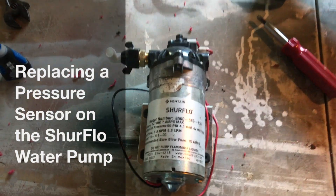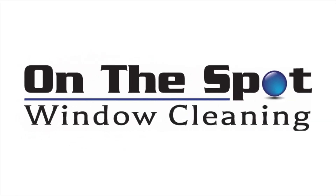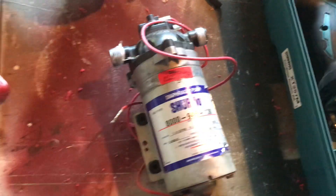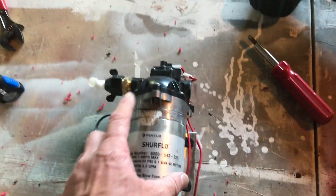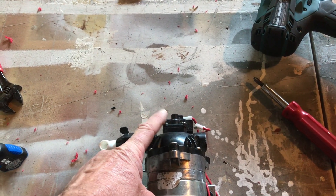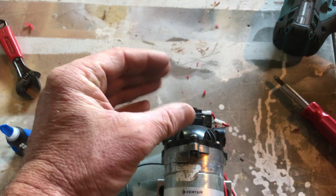Today we are going to try to resurrect a couple of pumps. A very important thing to know when you have a pump system for your water fed poles is that if the pressure sensor isn't set to run pretty much constantly when the valve is open, it will turn on and off, and as it turns on and off it creates a lot of heat and it burns out the pressure sensor prematurely.